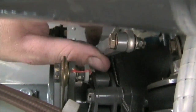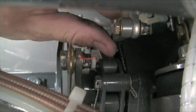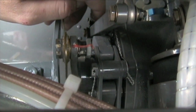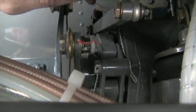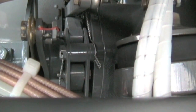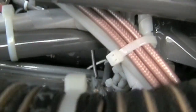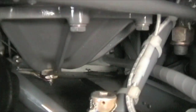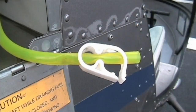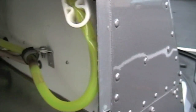This is your brake actuator. When you pull down on the brake handle inside the aircraft, this little lever comes up and presses a shoe on the tail rotor drive shaft to slow it down. One thing to watch: if you use the brake too much, it gets the main rotor gearbox seal right behind the brake very hot and can cause it to start leaking. If it does leak, you may not see much here, but it'll drift down and collect right by your firewall. We've sumped the fuel — reclamp the line and re-secure it.